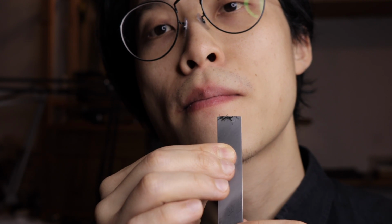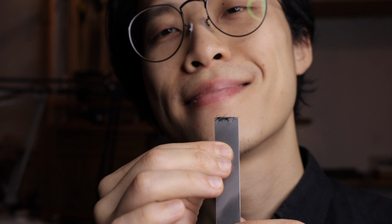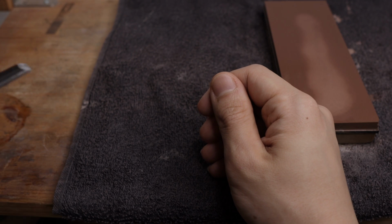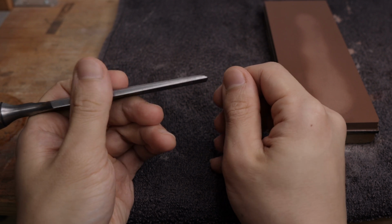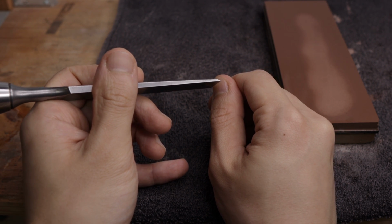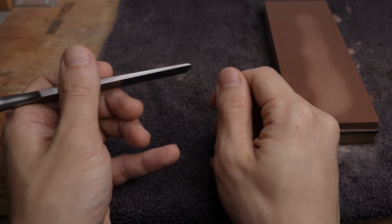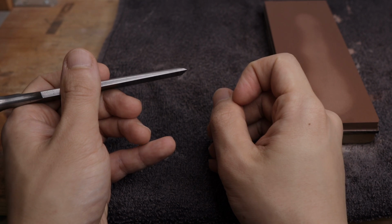And this is also one of the reasons why you should be more polite when you talk to violin makers. Just kidding. But of course, sometimes you're gonna use up your resources if you sharpen your tools every day. And in this case, you can just put the blade lightly on your nail. If it is sharp enough, you'll feel like it is grasping your nail, and you can feel that it is danger with your human instinct, then it is sharp enough.